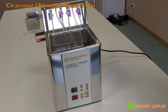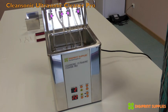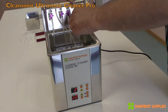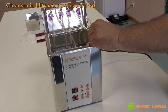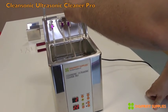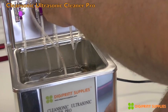The device has two independent circuits with two filters and pumps at the back, and two buttons: Pump 1 and Pump 2. Pump 1 is the circuit on the right; Pump 2 is the circuit on the left. In normal flushing position, with both levers facing the blue flushing symbol, switching on Pump 1 starts flushing cleaning liquid through the circuit and out of the tube. Click it again to stop. The same applies to the second circuit using Pump 2.